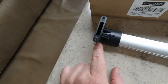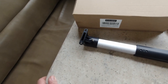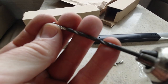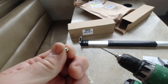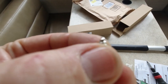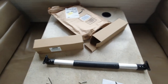So I noticed these two ends have pre-drilled holes, which makes it nice. And then in the middle there aren't any pre-drilled holes, and the same on the door. So I'm going to go get a little drill and a drill bit to make this easier. The drill bit should be just a little bit smaller than the screw — you want it just big enough so you can drill the screw in. You just need a little pinhole so the threads on the screws can grip and pull themselves in.